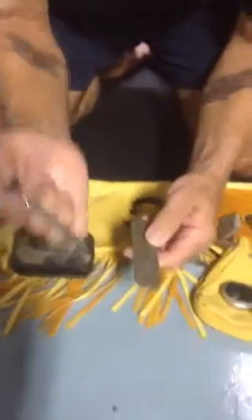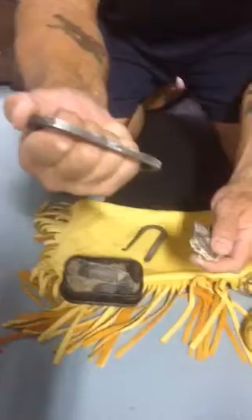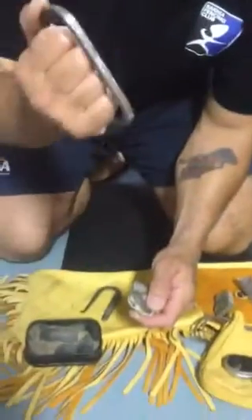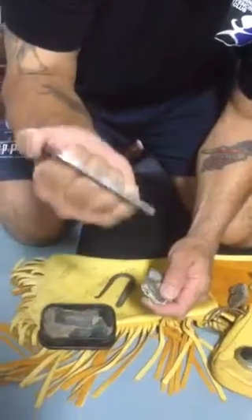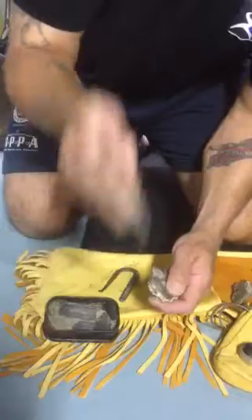This one and this one are the best. I can get better sparks out of this one because I can hold it better. This one does equally as well, especially if you get a good grip on it. But the one hardened only with powder — not so good. So when you're looking for a flint striker and dealing with a blacksmith or anybody who makes them, find out if it's hardened tool grade steel.